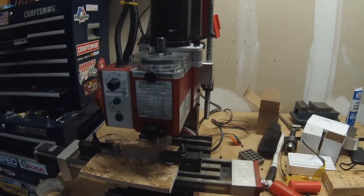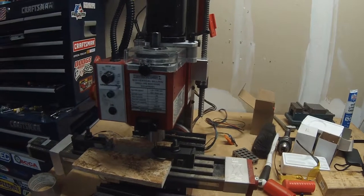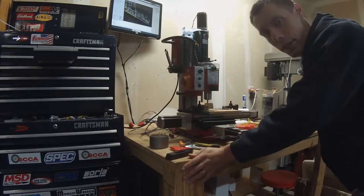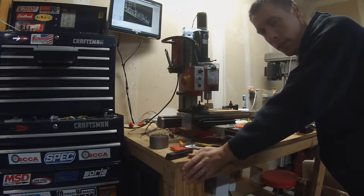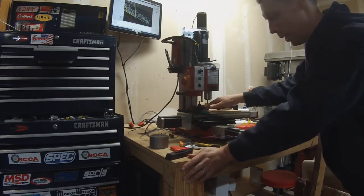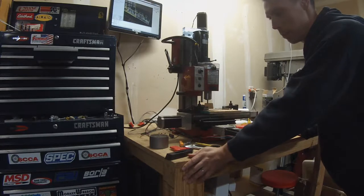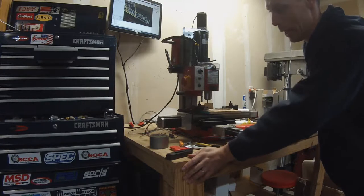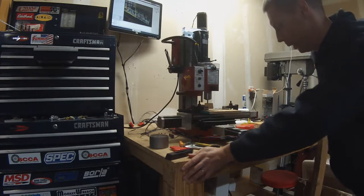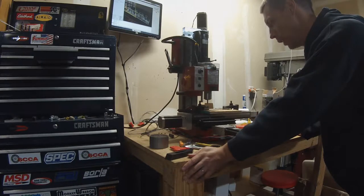I didn't have my mouse right where it should be. I guess we will continue to reset this and figure out what just happened there. My theory is I didn't touch off in the X axis correctly, mainly because I'm struggling with all these round surfaces to get a good actual spot to touch off. So I'm gonna bring it back further than what I originally did, touch off the X axis again, and run it maybe a little higher up just to make sure.